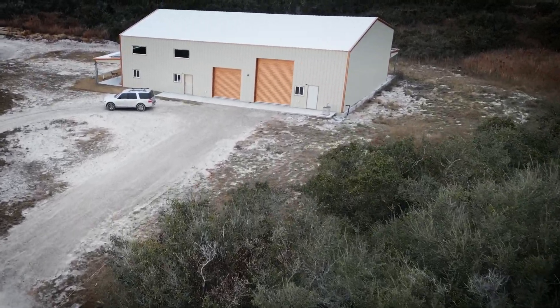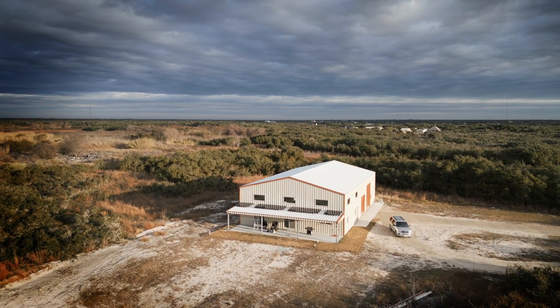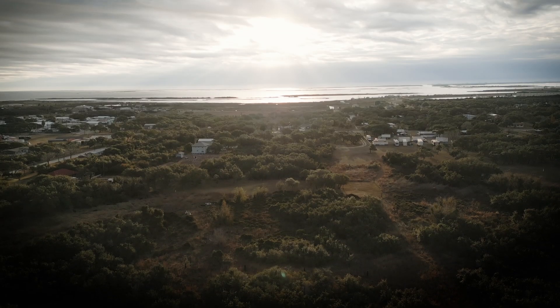I did learn something from that. The garage side has three roll-up garage doors that are unsealed — eventually I'm going to put brush seals on those. It's very difficult to keep that under control because the turnover of airflow in there is incredibly high. On this side of the Great Wall of China it's much more sealed. There are also eight picture windows up high, which actually helped with solar gain and kept the living space a bit warmer than the garage. The garage has just two three-by-three-foot windows — I wanted to control light in there. But the solar gain from these picture windows does keep it warmer.